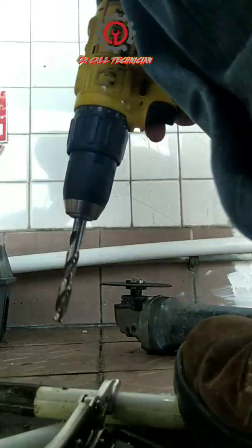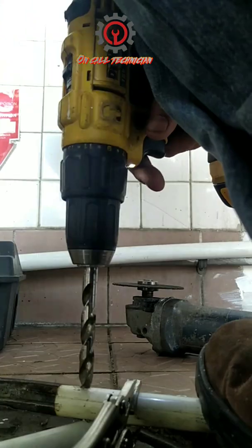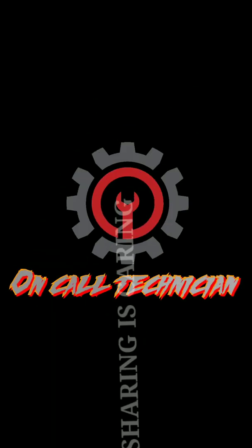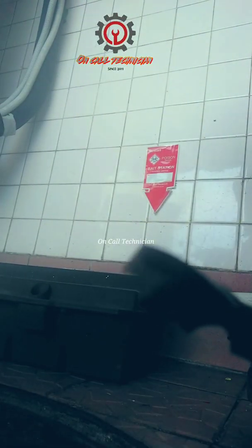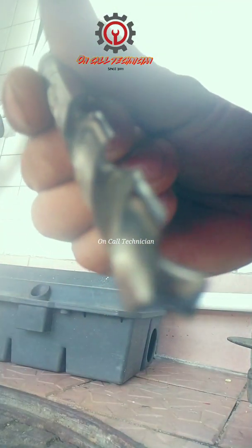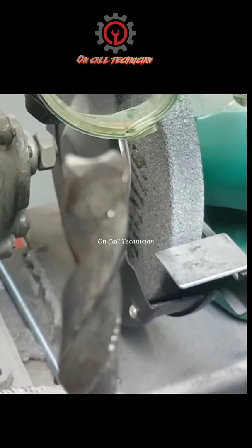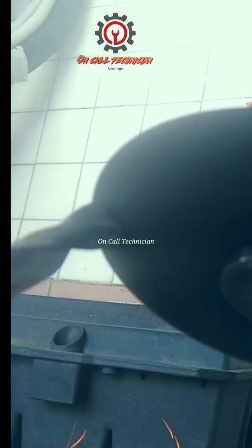Testing after sharpening. Welcome to my YouTube channel guys. Today I'll show you how to sharpen all damaged tips on the cutting edge of the drill bit. Since we don't have a bench grinder and we're on the spot repairing the drill bit, we're sharpening it using a grinder.